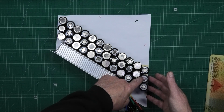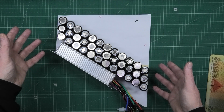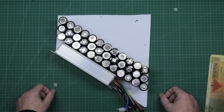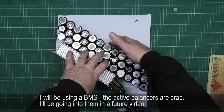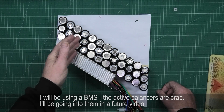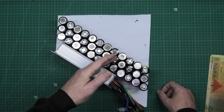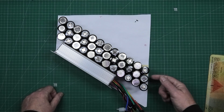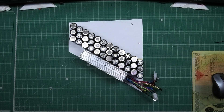So we've got 12 cells in series and three in parallel, which will give 15 ampere hours and around 60 amps burst for a few seconds. I'm not fitting a BMS as such — I've decided to put one of these active balancers on instead, so the cells never go out of balance and you never lose power during balancing. I'm just waiting for that to arrive so I can start building my battery.